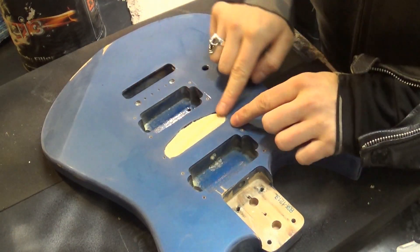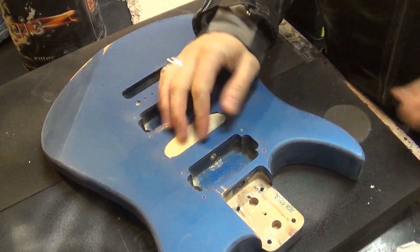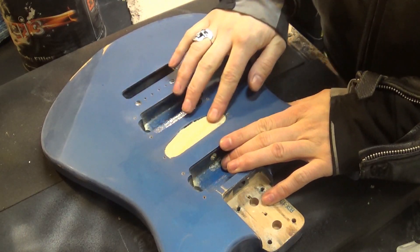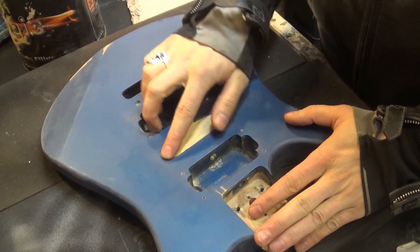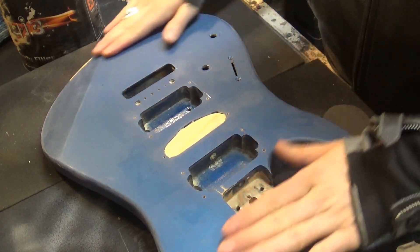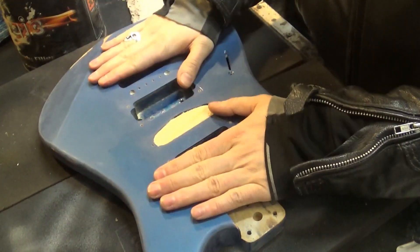It's the next day and this little piece over here has been glued in place. I put a little anvil on it so it doesn't pop out, because the glue expands inside. So that's glued in place permanently. I'm gonna use some body filler just to make it as smooth as I can, and while I'm at it I'm gonna fill this little hole that the customer wanted filled. There are also some small imperfections on each side I'm gonna deal with as well. Let's do this.